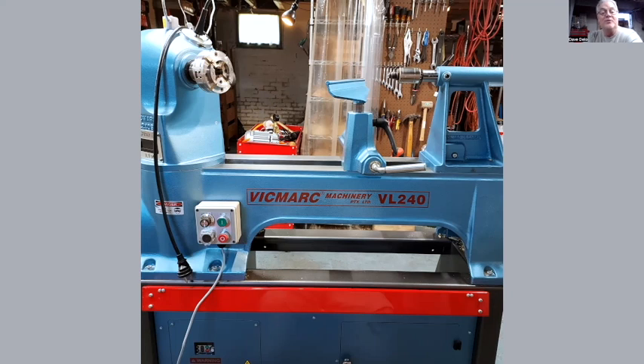This is the machine — I'll give you a few specs. It's 19 and a quarter inches of swing, which is a strange number, but it's got enough swing to do any of the bigger pieces I want. It's a nice short compact machine — you get 23 inches of usable space between tailstock centers. I'm a bowl and vase person, I do hollow forms, so I don't need a long lathe. It's a nice compact unit with no controls on the headstock — everything's on the pendant.